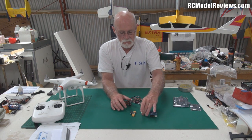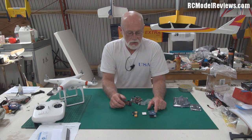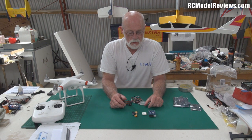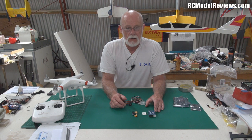It's pretty straightforward and not that complex. It has an on-screen display, which I'll show you in a later video along with the different options available. It has gyros to give you stability, so you can turn it into a stable mode and it will keep your aircraft straight and level. It also has return to launch — if something goes wrong and you lose the radio signal, or if you're just too lazy to fly back, you can flick a switch or the failsafe will kick in and it'll fly back to where you launched from. That's a wonderful safety feature for any FPV craft.